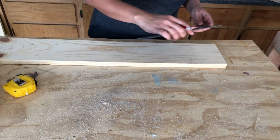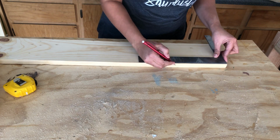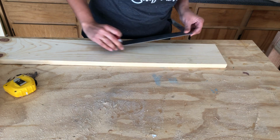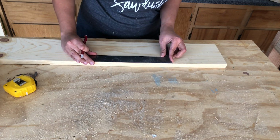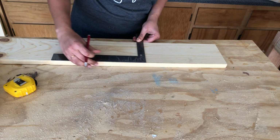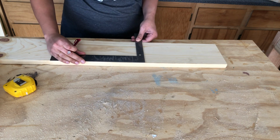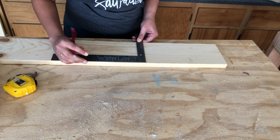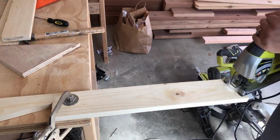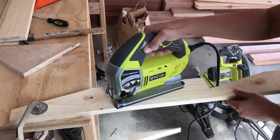Now for the angled bin sides, I used a 1x6 board. I started with 1.5 inches from a corner and went 7.5 inches down and joined these 2 points, and this was the cut line. I repeated this after leaving 3.5 inches where the bin slats will go. It can get a little bit complicated, so be sure to grab those plans that show you exactly how to do this. Once I had the 2 side 1x6 boards marked, I cut them out with a jigsaw.